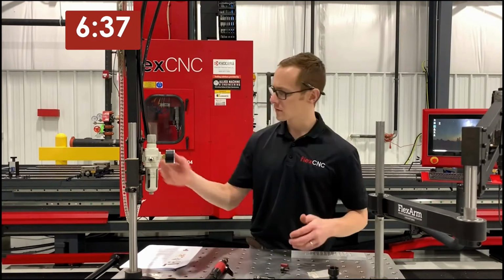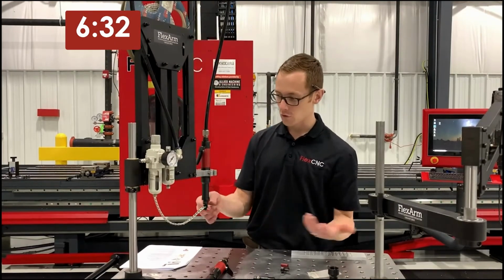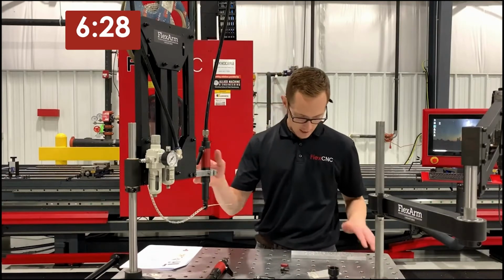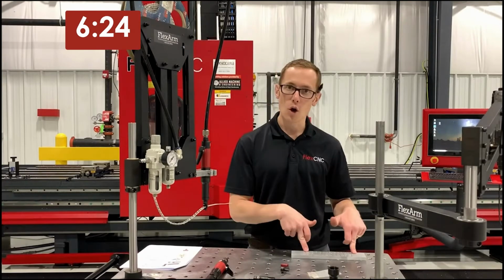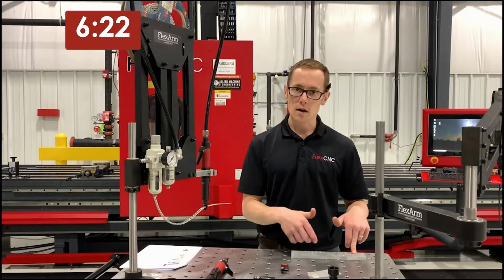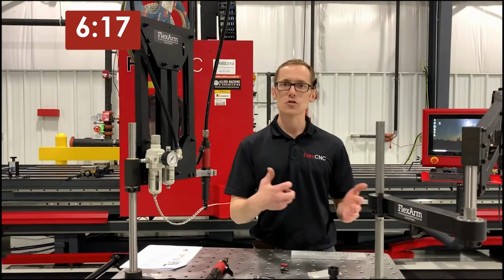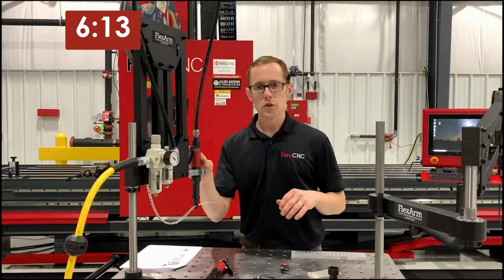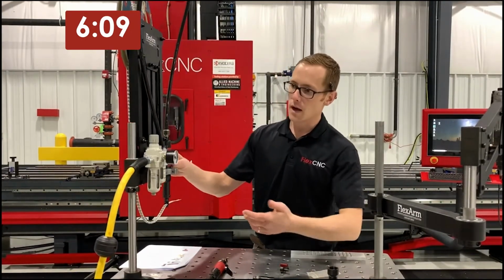So now we're ready. Today, what I'll show you, I've got my arm set up here to drive quarter 20 helicoils on this strip feed, and we've got a nice aluminum piece here ready to place those. This is a blind hole. We're going to drive them to the bottom. Depth's already set, and it will automatically revert. So it automatically drives it to the depth and then automatically reverses. You'll hear the motor has a hissing. That's normal. It's designed that way.